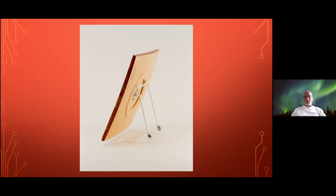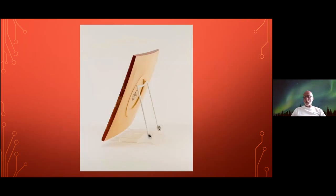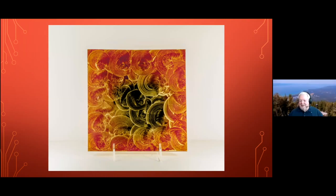The only thing I would say in terms of process: if you turn the platter just as if you were making it without paint, you have to get it perfectly flat, smooth, and sanded, because any defect in your finish or sanding telegraphs right through the finish and you will see it and not be happy about it. So that's the piece — COVID piece number 33 or something like that.